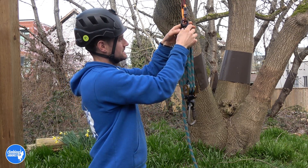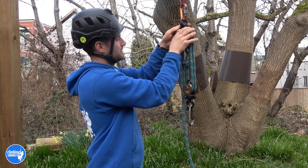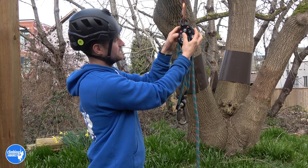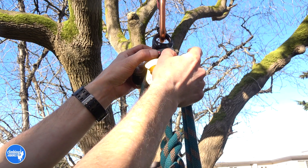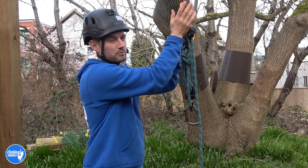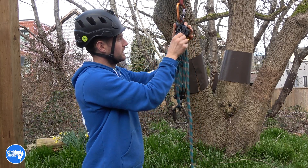This line of pulleys also has this opening system so you can open up the side plate of both sheaves. They have a red indicator — you pull down on the lever, push up the red indicator, then swivel and place your rope inside. You don't have to disconnect from the connection point at the top to install the rope; you can install it once it's all connected up, which makes setup easier.